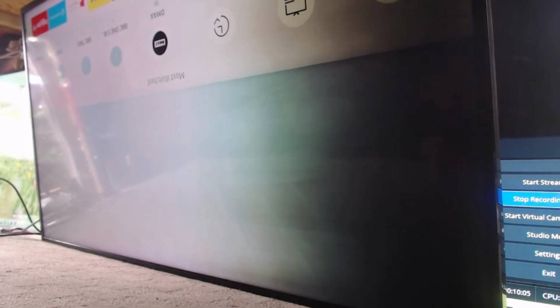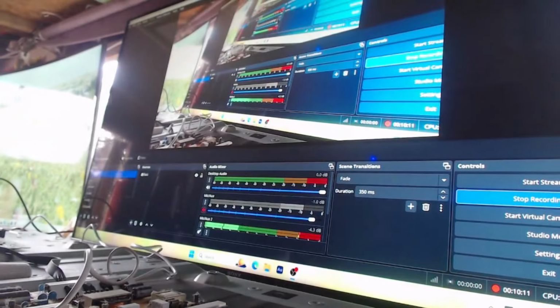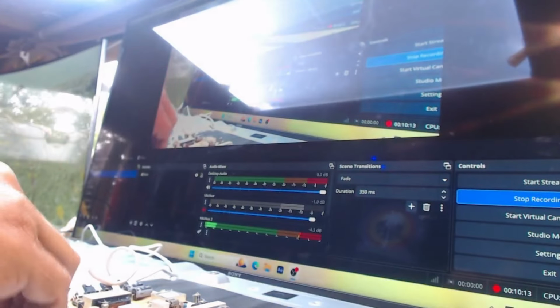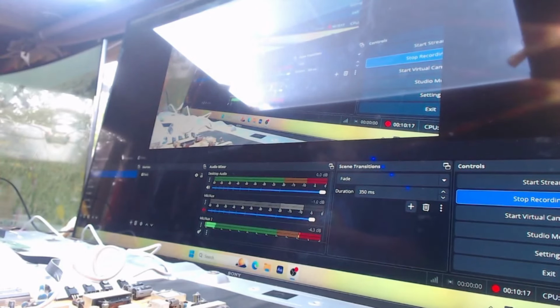No, three quarters of a picture back, and I have to confess that it doesn't get any better. I kept trying for another half an hour. I block off the COFs, and I sort out where the shorts could be on the clock lines, but it doesn't get any better than that picture you've just seen.